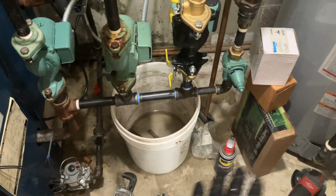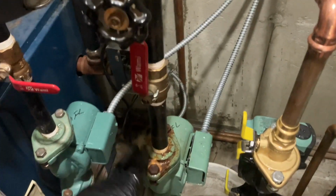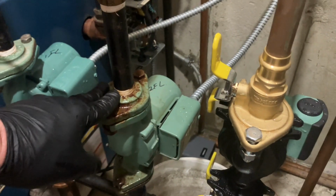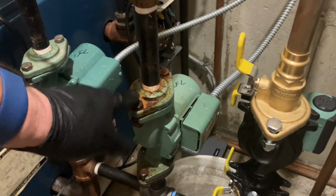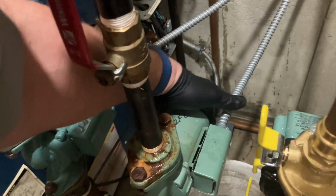Let's get rid of everything water related, fittings, press, and focus on wiring. And I don't have a second circ on the truck, so the runner from the shop, Peter, is gonna bring us another circ, 2 of them, one to replenish stock and one to replace this circulator because it was overheating on previous service calls and customer wants us to change it out.